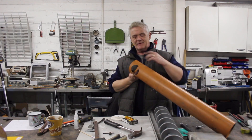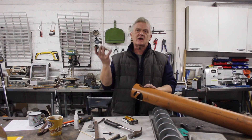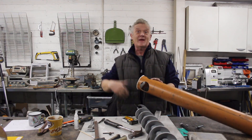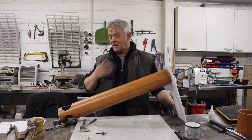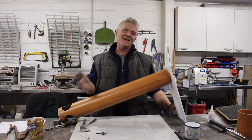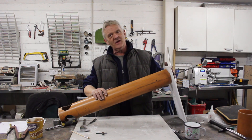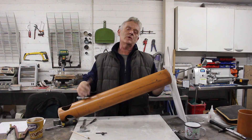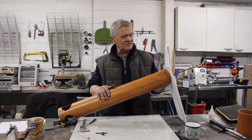In the bottom of my waste pipe I've just drilled these drain holes, and then I've made a cap that just goes in there — we glue that in, drop that into the cap, and that will centre it. I've put this little foot on it to hold it at an angle for the test. Clearly, in a real installation we'd put this in a stream where the water would be blocked and only have this exit to go to. If putting it into a drain, you'd put a swept tee fitting on it or something like that.